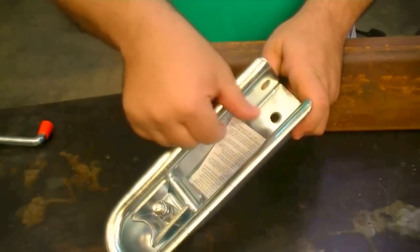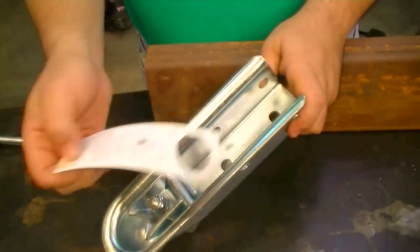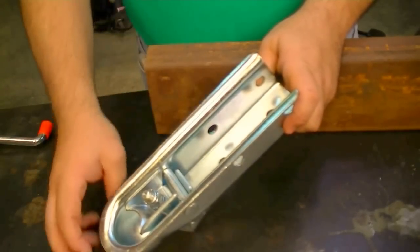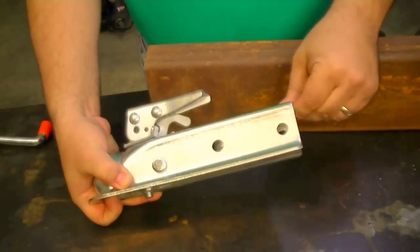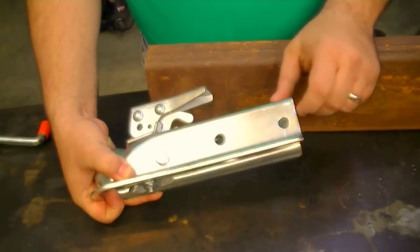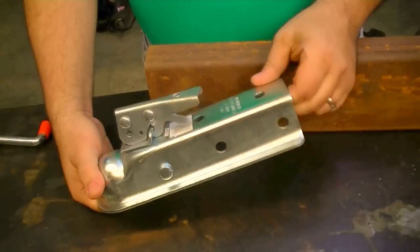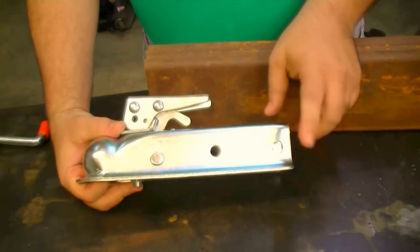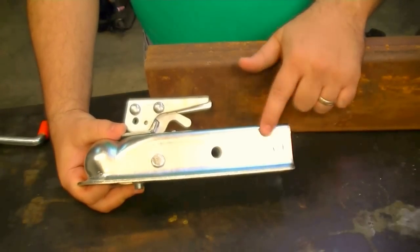Most repair or replacement couplers have a tag that'll actually give you instructions on whether to weld it or not. This one doesn't have any preclusion from welding and I've checked with the manufacturer that says it's okay. You can see the holes here all the way around this — you can actually use bolts to go through here or you can plug these holes with a plug weld. Then we can weld the coupler around the sides here to hold it on. If you've never made a plug weld, it's something that takes a little practice. Don't try to weld a coupler on the first time out — if you haven't mastered how to fill these holes in, you might be better off just to bolt it on.